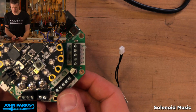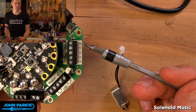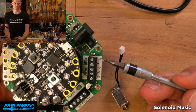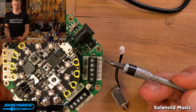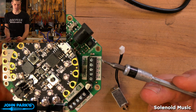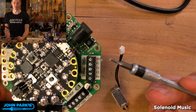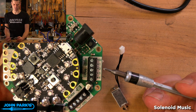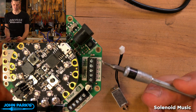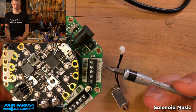Okay, so you can see here, this is our drive section. It has a single terminal for the 5 volts, which is energized, and then we're controlling these 4 ground pins. So with multiple solenoids, you can plug one wire of each solenoid all into this 5 volt, and then one wire from each solenoid, respectively, into these 4 pins for the drive's grounds, and that's what gets triggered when we are asking a solenoid to go ahead and drive.